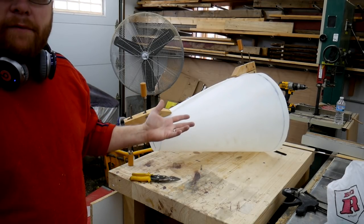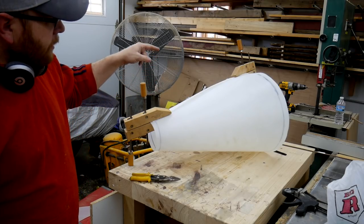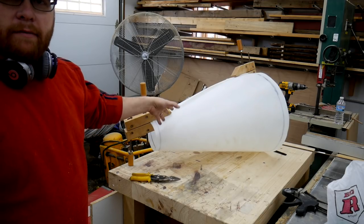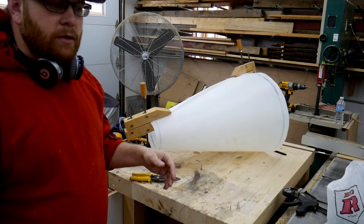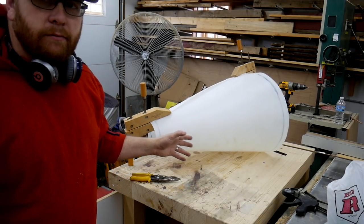Because, for obvious reasons, right? I wanna make sure the air doesn't escape out through the seam. So I'm gonna probably put a rivet in about every half inch. I bought 50 rivets, and this thing's about 27 inches tall, so almost a rivet every half inch, and that combined with the silicone ought to make it nice and airtight.